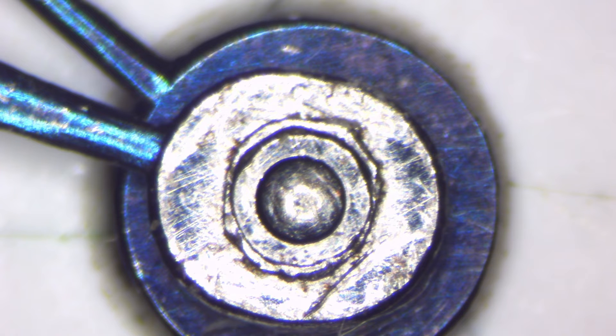You can see how rough the metal or material looks on this watch. This is also why when you're burnishing the hour wheel or minute wheel to fit it on properly — or trying to make the hole smaller — you're working with metal that looks very rough at this level. It doesn't have the accuracy you'd expect nowadays, but back then I think the accuracy was in the machining tolerances. And here we have some of the painted-on lettering on the watch.